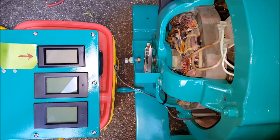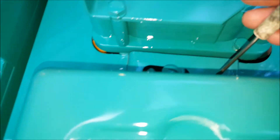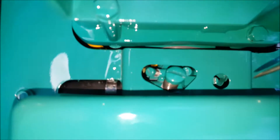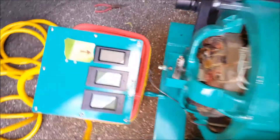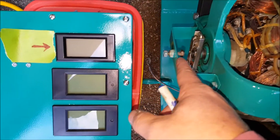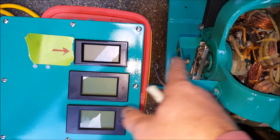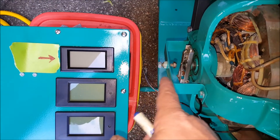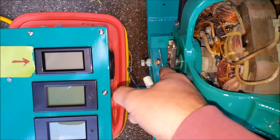Right now everything is off. I'm going to start the generator up, and the way I'm going to control the speed is by using the idle set screw, which is right down here. It's going to be kind of hard to do while holding the camera. I'm going to increase the speed little by little and focus the camera on this as well as the hertz meter. When I first start up it's going to be about 61 hertz, which is normal, and I'll increase the speed to around 74 hertz — I expect this thing to go like that.